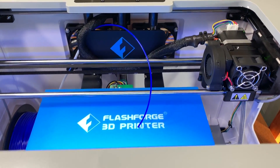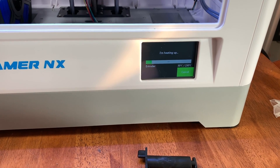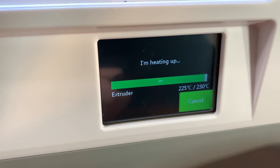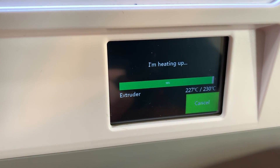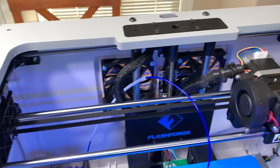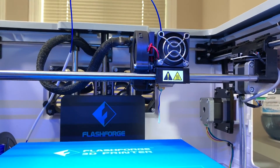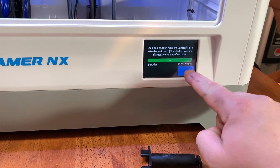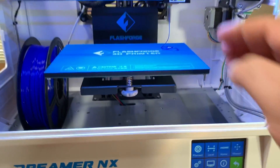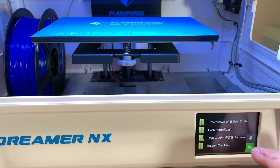It comes out the top as shown. So then we've got to go to filament, go to load, and it's going to heat up. Once it's ready, just slide this over and push the bed down — there we go, you just got to feed it in a little bit. I'm just going to let it feed like that for a bit, let it come out, and then when you're done you press the button, go to return, and you can just peel that off. There we go — I've got it loaded.